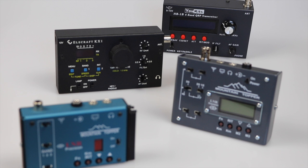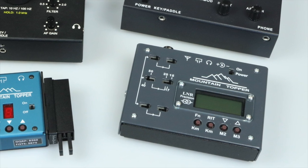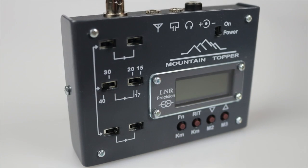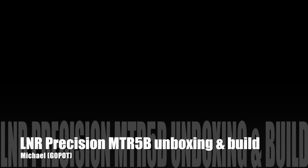The MTR-3B is a miniature marvel with three bands and a basic but functional interface. Its big brother adds a comprehensive display and covers five bands. The KX1 has two-to-four band options, more control, and can receive SSB and AM. The Ukits HB1B offers KX1-like features at a price point between the two Mountain Toppers, though the quality isn't quite as good. The MTR-5B is available from LNR Precision in the US, or for UK and European hams from Kanga UK. 73s guys, get out there and enjoy your radio.